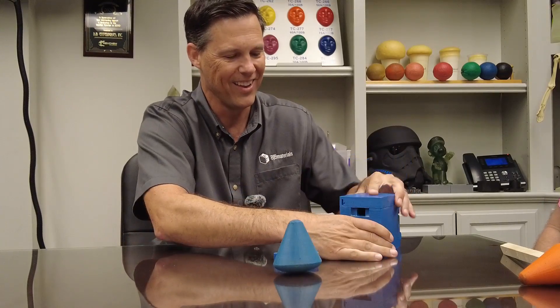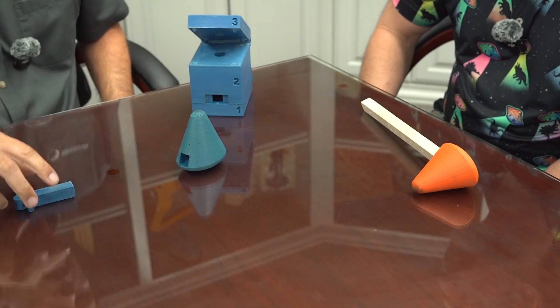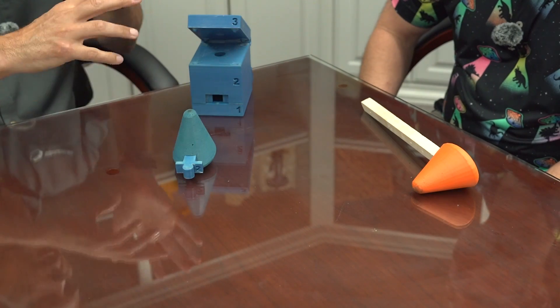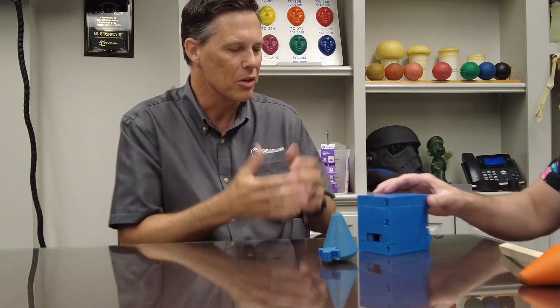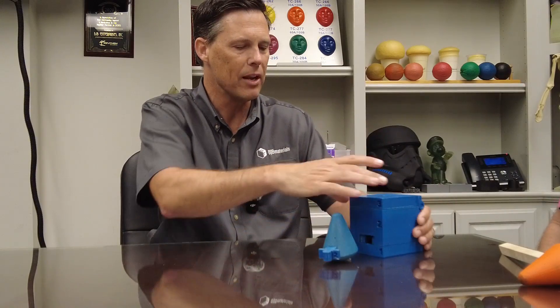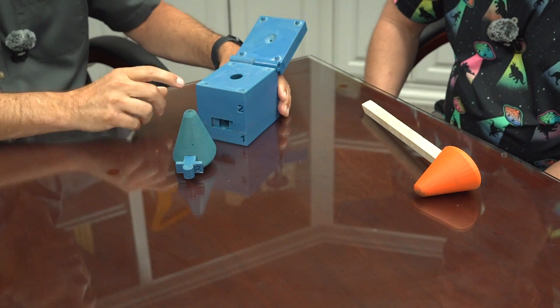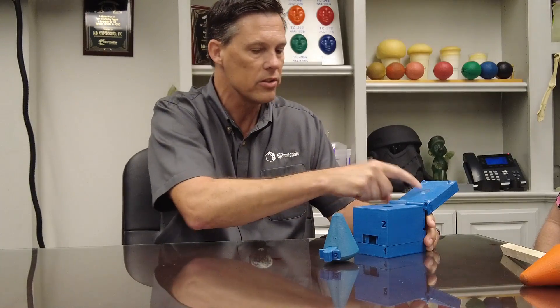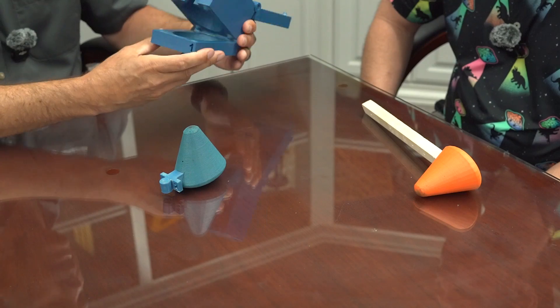By inverting the part, Troy figured out the ideal pour orientation. That component visible on the mold is the vent. Whenever you're doing foam molds, a lot of times people have vents that are way too big and let all the back pressure out, or they put their thumb over it. If you can design the tool to do it right, you should. The solution was a bigger pour spout with nice rounded geometry and then just a small vent — and it worked out pretty well.